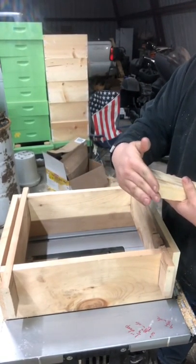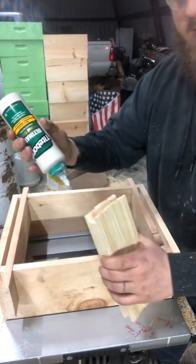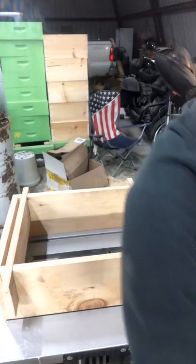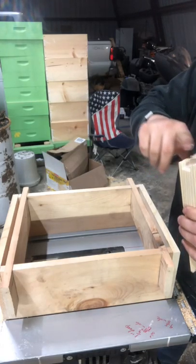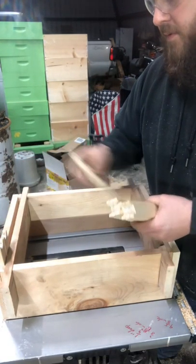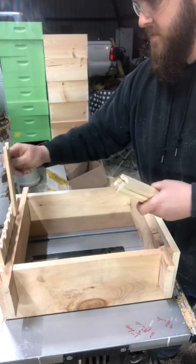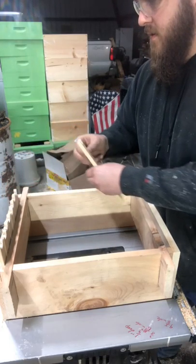What I'm going to do is get all these, kind of make them even in my hands. Take my Titebond — I'm going to go ahead and goober it up there, right there, do it on the sides. That way the glue will get to that top bar. Let's go ahead and place it in. Now you can probably glue them individually, one at a time. But we're making a jig to try to save time, so why not glue the mass of them in your hand and then place them in so you can just keep rocking.